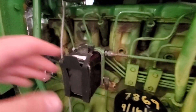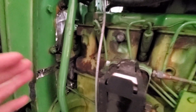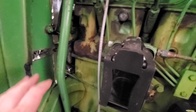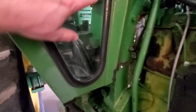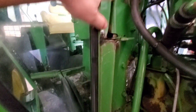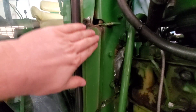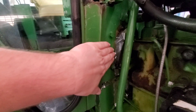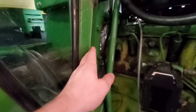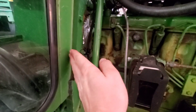Original patina and clean is better to me than spray-canned or splotchy paint over wiring harnesses. This is not a full restoration — this tractor is going to be used on our farm. We just want to make sure it's 100% up to par and as factory original as possible, while also addressing a few problematic areas. This was a Henson-made cab. You can see the dash cowl comes down, and the front window panel lines right up with the firewall. On a 4320 this cab would sit out over the engine a little far and they used a special side panel, but on the 4620 it fits very, very well.